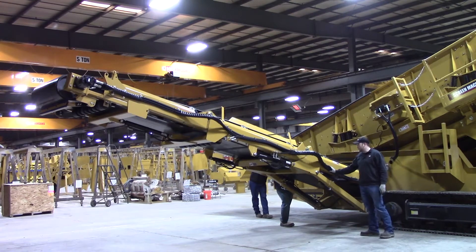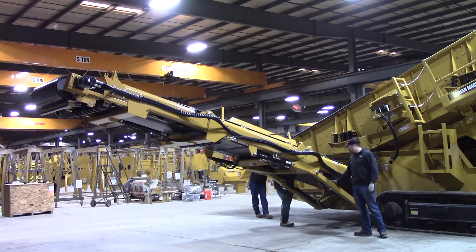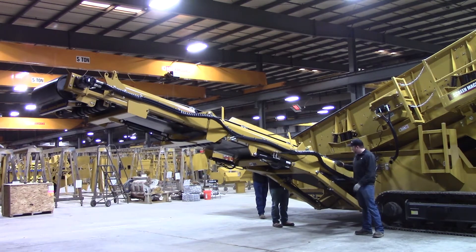On this fine stacker here, we'll start with this one. You should already know how to work the valve over there. Right now we're at our lowest setting — it's 18 degrees. We've got it pinned in just like this. You'll only need to be working the valve section for the lower section of this conveyor like we were doing earlier. I've got Mark over on the valve, Scott on the opposite side, because you've got a pin on this side and a pin on that side. We'll go ahead and remove these pins at the lowest angle.